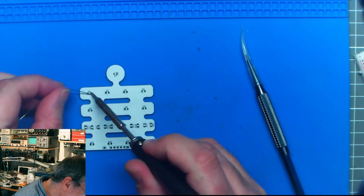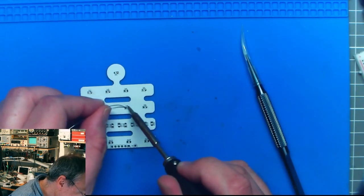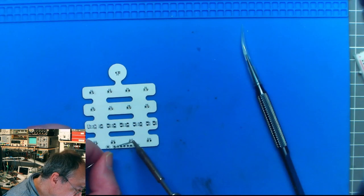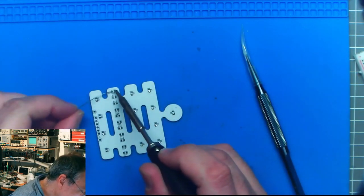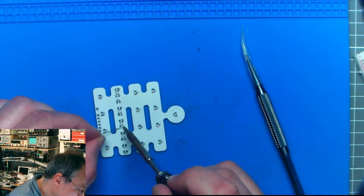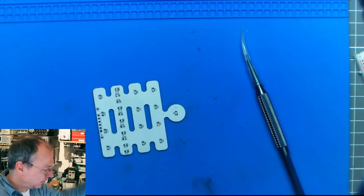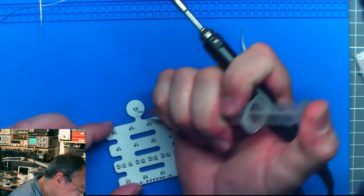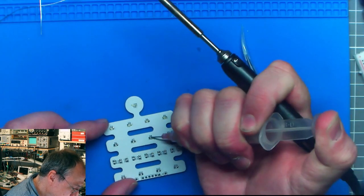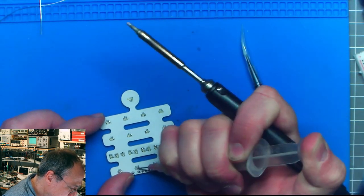And let's put a dab of fresh solder onto the right pads. For the lower row as well. And top pads for the middle, they are rotated 90 degrees. Like this. I will also put some flux onto all of these. Kind of Rossmann style. Like this.